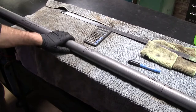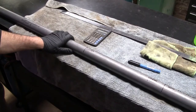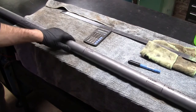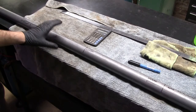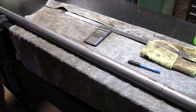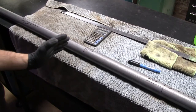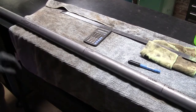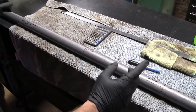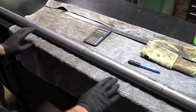First tube, main hoop. This is the big one. This is the 44 mil, or 1¾ freedom units. Bit of a tricky one, four bends. The overall width is obviously very critical. I think my plan of attack here is I'll start from the center and work out, and hopefully then I can do a little bit of course correction along the way. So off the CAD, I've worked out where the bend should start and the angle of the bend.